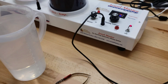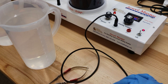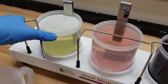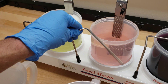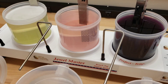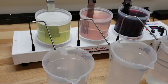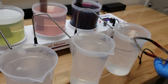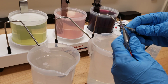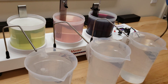For this situation, we're going to use the common lead to clip to the part, instead of hanging it from the bus bars like you would with jewelry on a rack. So we'll swing the bus bars out of the way. I have the machine already set at 8 volts, and I'll clip right here, and we'll start by electro cleaning.